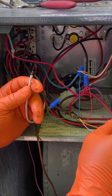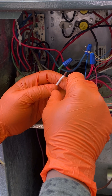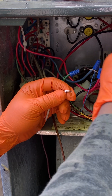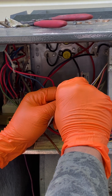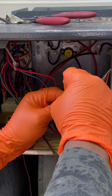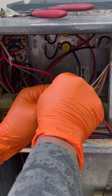The white wire is for the heat — emergency heat or auxiliary heat. One from the air handler, one from the thermostat, and a third one from the outdoor unit, so you're going to connect three white wires together. That's what your auxiliary is — that's what your auxiliary is for the heat pump.